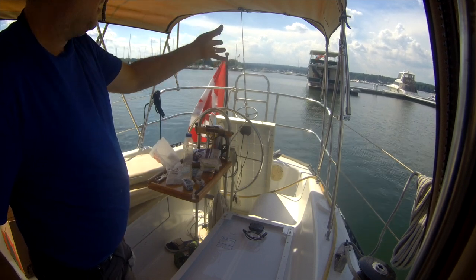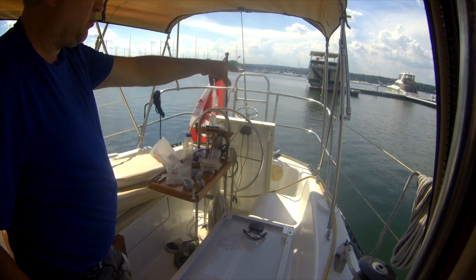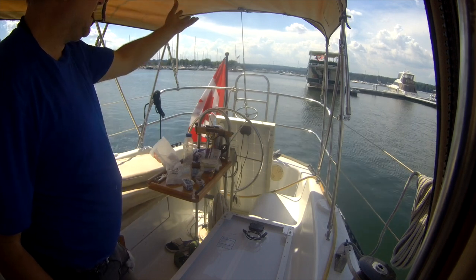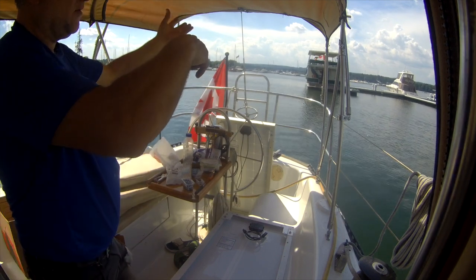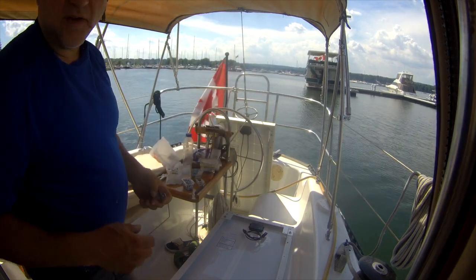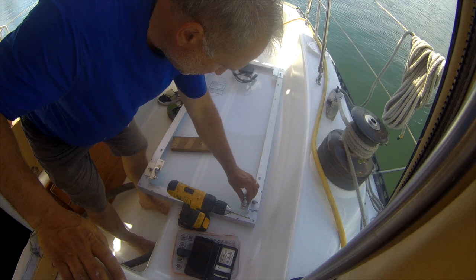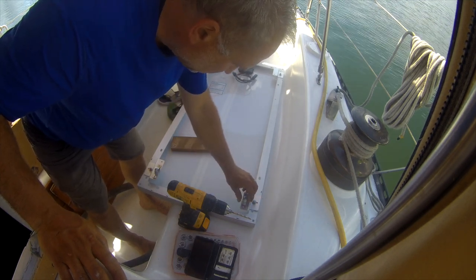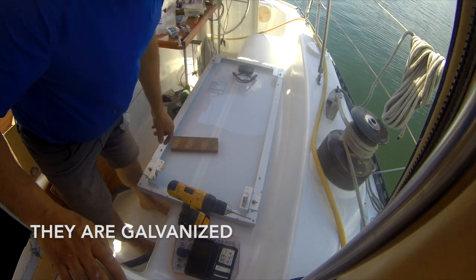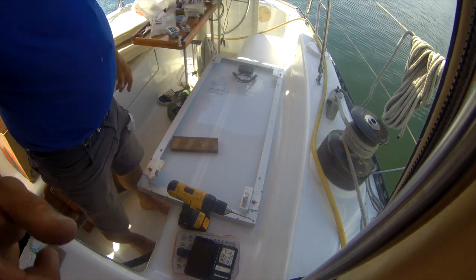I've pulled the weight forward. I'm going to put the solar panels on top of this, and it's got one, two anchor points plus the guard rail as a supporting piece, so there's a lot more strength. When it was hanging out over the back I thought: if the front ever let go, it would tip back. But in the middle there's a lot that would have to let go for it to fall off. I'm drilling some holes and attaching wire clamps for electrical. This is the only piece that's not stainless, so I may need to find hardened plastic or something.